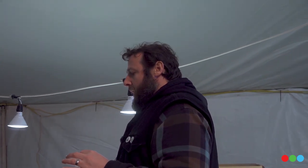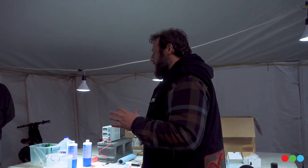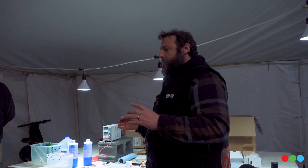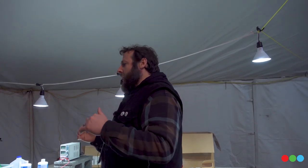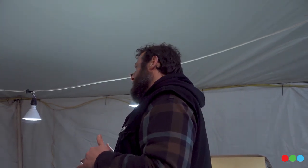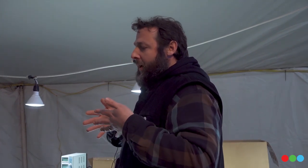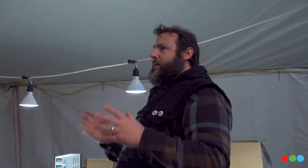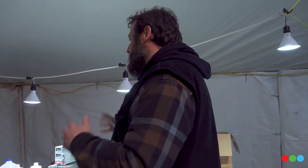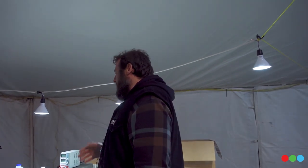And that was a big step forward because I already understood how all the electroforming gear worked. But what I discovered instantly was that painting the copper conductive paint onto sandblasted glass and electroforming onto sandblasted glass is not only much, much easier, but you get a much, much better coating of copper. And the engineering behind it, it bonds to the glass much better too. So there are all of these really good reasons to go further with that. Then after hand cutting stencils for six months or a year, I finally invested in a plotter to help me cut out my designs.